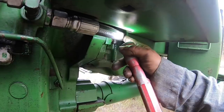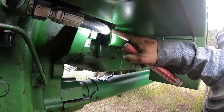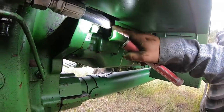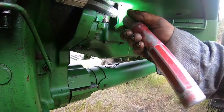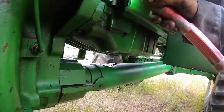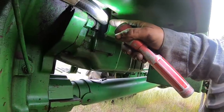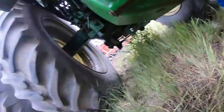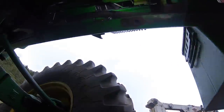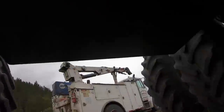See, that tube was made to where it went around that corner. So the hose is gonna rub right on the corner of that frame flange, and that's not good. We gotta get some radiator hose or something and cut it and shove it in between there, and that way it rubs on that instead of the hose. Protect that. But other than that, the hose set up, I got it tucked up in the frame rail. Turned out pretty good.